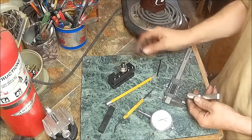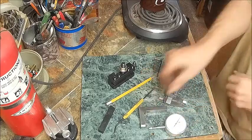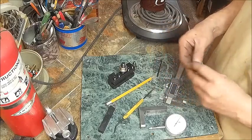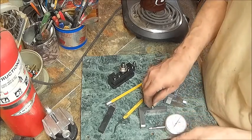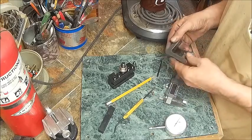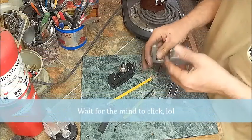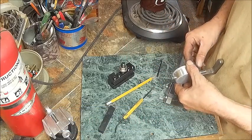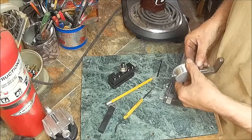Then again, I could use a smaller set screw - an allen head - because I'm never going to be taking this out anyway, since that's all it's going to be used for. I could use this one since it's a finer thread and just shorten it. Sure wish I'd made that a little wider on that side. With this one I only get about two threads, but if I shorten this one I get about four threads, which means I'd have to cut that hole close to the edge.